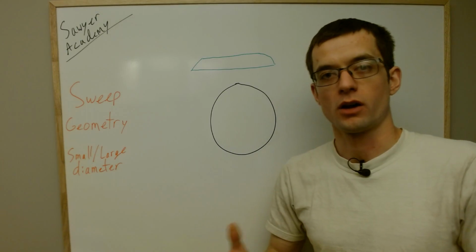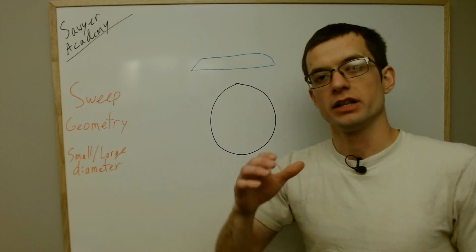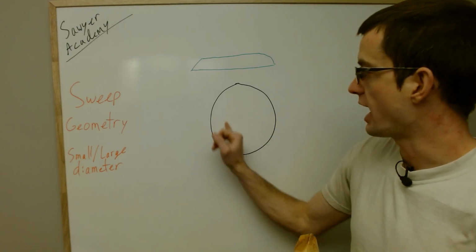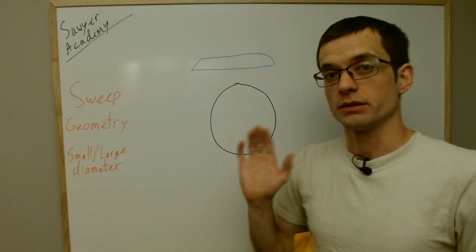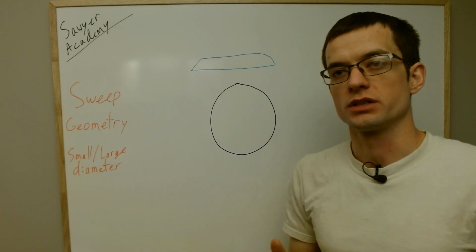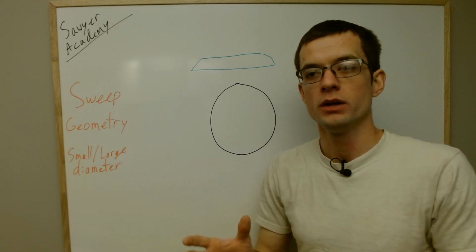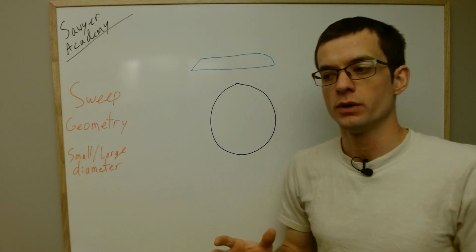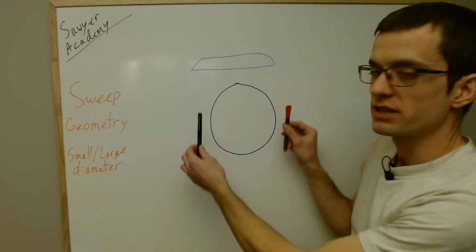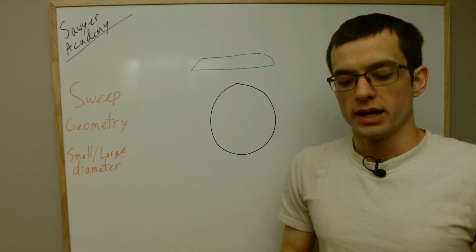In a different type of sawmill called a scrag sawmill, which you may have watched a video on already, generally the Sawyer will be sitting looking down the length of the saw line, so you're looking at the end of every log as it progresses through 2 vertical saws at the same time. Before it goes through a saw, usually a computer will turn each log for you. If you don't have a computer that will turn it for you, what you'll have are 2 vertical pineapple rollers, which will grab the side of the log and twist it up and down 180 degrees either way